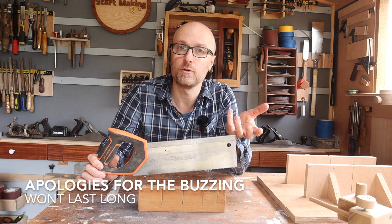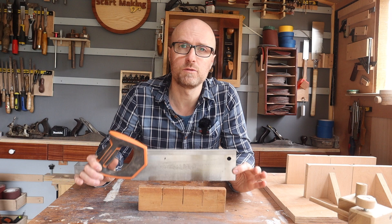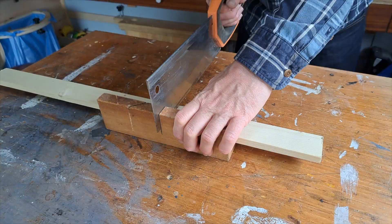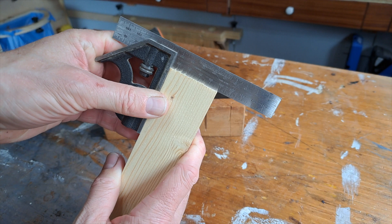It was just cutting square. No matter what tools you start out with and whatever projects you're working on, you need to be able to cut square in two directions, not just one. If you only have hand tools available, the lucky thing is there are jigs and tools that will help you cut square. For instance, a simple miter block — not only does it keep you square in one direction, it also keeps you square in the other, and that's brilliant.